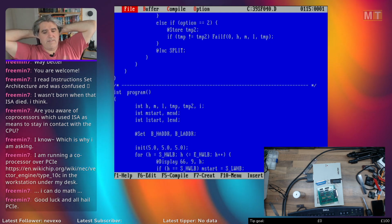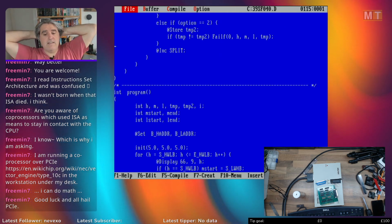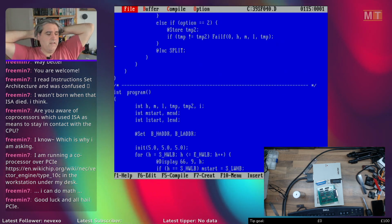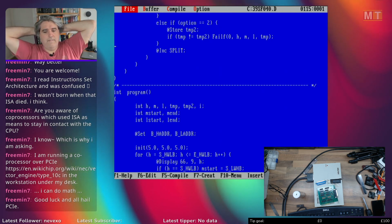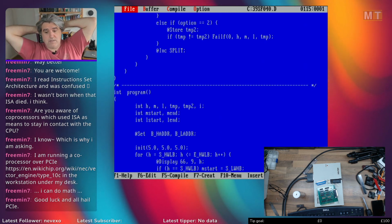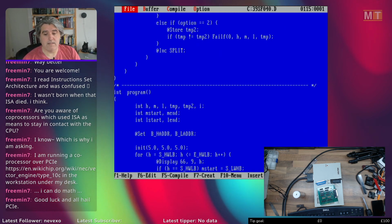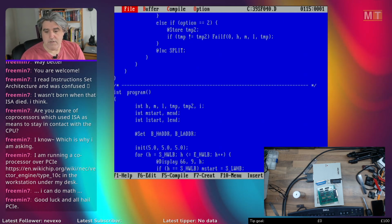I mean, if it weren't the fact that it was only 5 volts, I would consider using a small CPLD instead of all the logic chips. But most CPLDs are 3.3 volts only now, so that makes it harder to work with. So I would keep it as discrete logic chips, but I would consider going to fully surface mount. It would make it a smaller circuit board, which would make it cheaper to manufacture. It would make it cheaper and easier to get hold of the components, because through-hole ones are getting harder to get at a reasonable price now. But you can still get them as surface mount for a lower price and higher inventory stock levels. So I'm considering creating a surface mount version of it.